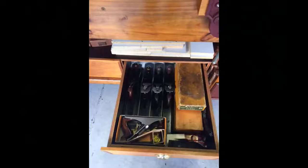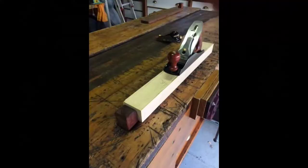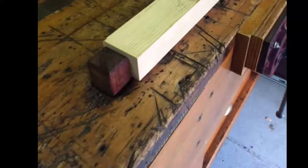I put Merbau around the bottom of each leg as they needed some reconstruction. The blue record is original fitment with one from the other side missing. I mounted two Dawn Australia vices and having two works a treat. The old stops were replaced with hardwood. Notice the giant wing nut underneath securing the stop, donated by Ian Kerry and sourced from an early Holden. That's a car from Australia.